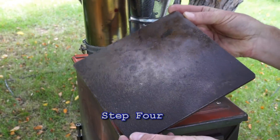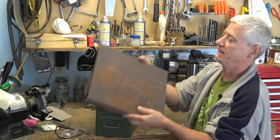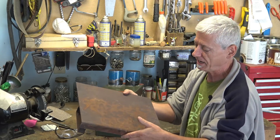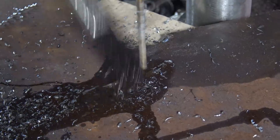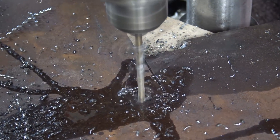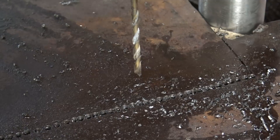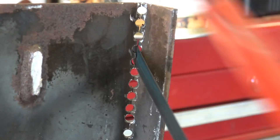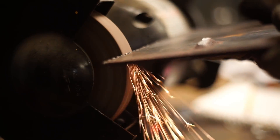For the cooking top and the door I needed the thicker steel plate — I have this big piece rescued from a barbecue, it's nice and thick. The problem is how to cut it, since sawing with a hacksaw or jigsaw would just wear out blades. So I drilled the outline, using oil to reduce the friction. The space between the holes was cut out by hacksaw, then the edges ground and filed down. It was a lot of work.